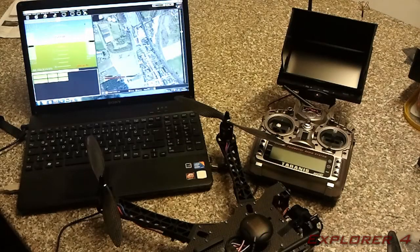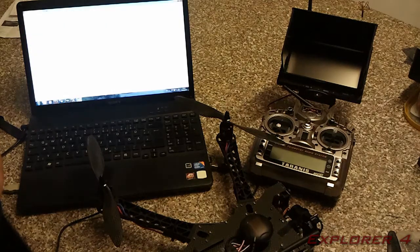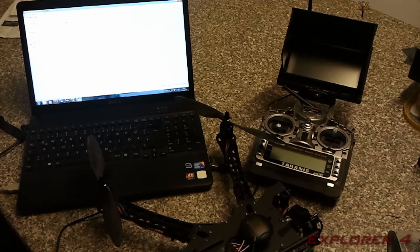Right, I'm going to talk to you a little bit now about programming the MinimOSD and setting up the FPV camera. Basically, what you need to do is go onto the Arducopter website and download the config tool for the MinimOSD. I'll include a link below this video where it is.